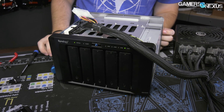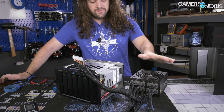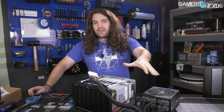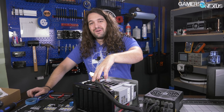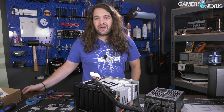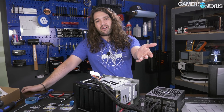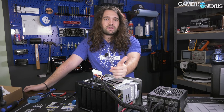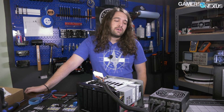Not sure if it's a dead power supply, dead power delivery, bad motherboard, or bad power board — but it's working now. The problem isn't necessarily difficult to fix, but we clearly can't just operate with an external ATX power supply sitting outside the NAS long-term. I don't know how trustworthy that setup is or what other problems it could introduce. We're splitting power: one supply for the hard drives from this defective unit, and another for the rest — not really something you want to trust your business with.